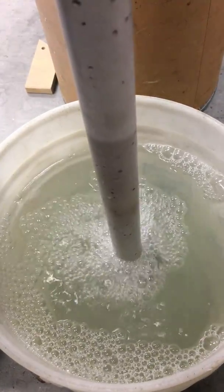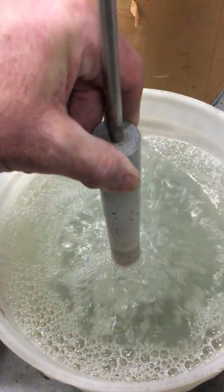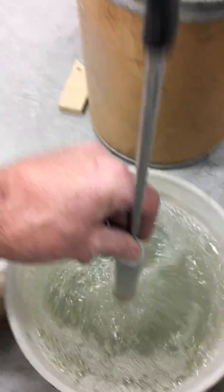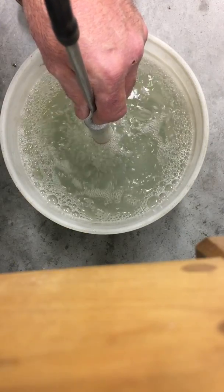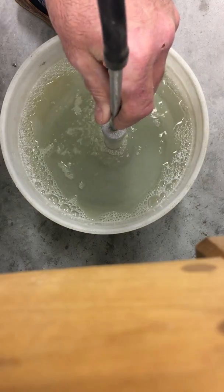I think this is pretty good news because it says I can get pretty good flow and aeration of the aluminum at a very low pressure. So if I just back it down to 3 psi, you can kind of see the bubbles coming up there.